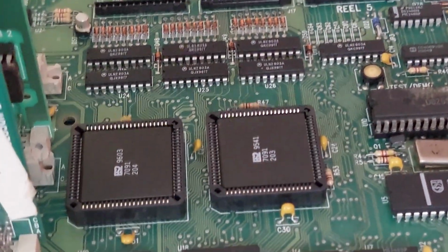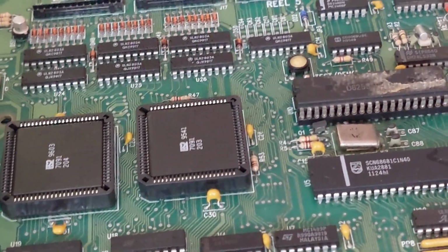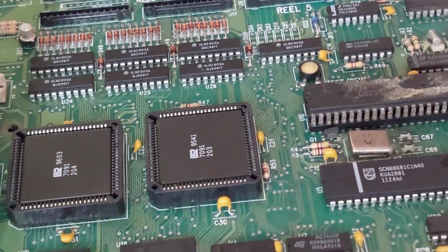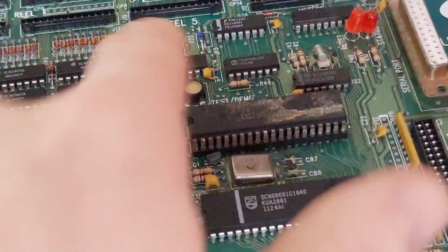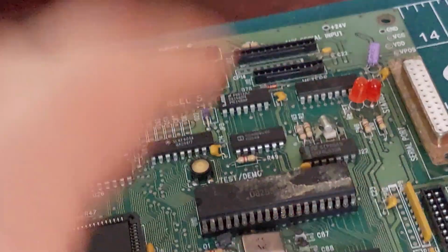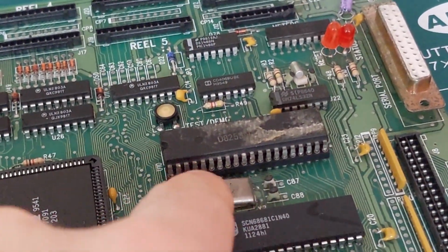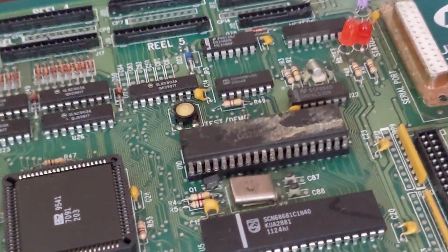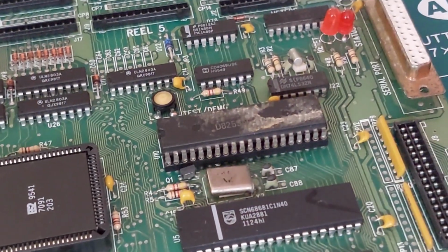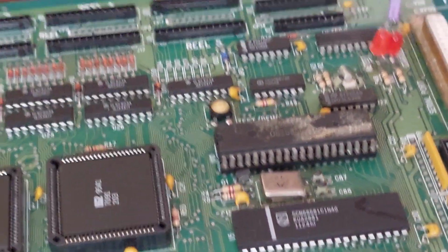So, what do you think? I reckon if you know how something goes together and you know roughly how something works, you could probably fix just about anything without schematics. You just have to think about it a little bit. Think about, what is this? Do look up the data sheet for this, look up the data sheet for this, trace some things out. How do they connect? Where do these connect from? Well, we know from previous experience these connect here, but just trace things out. Draw diagrams. Borrow a working board and record some signals, and in doing that I found that pin 5 there was stuck, which happens to be select pin, which certainly wouldn't be helpful then, because that would mean that was selected all the time. But yeah, we are working, alive and fixed to an extent.